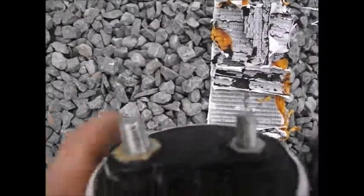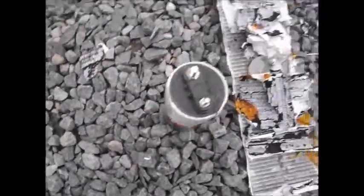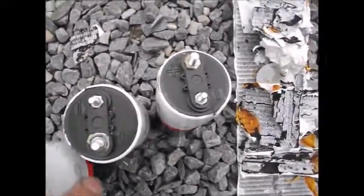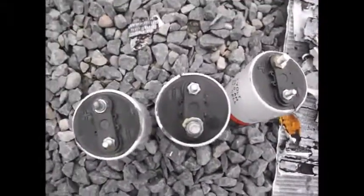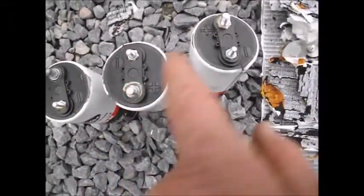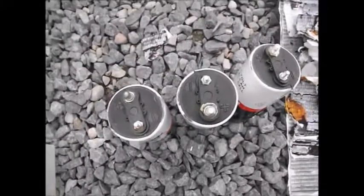As you can see the threads here — they have these little plates that go across that join them together. So basically they'd be upright like this, then you take another one upright like that, and another one upright like that, and these little plates go across to join your cells together. This one here would be 6 volt if it was just three of them — a plate would go from here to here, you put your lock washers on and put your nuts on top, and your positive would be here and your negative would be here, and that would give you 6 volts. Okay folks, thank you for watching. Subscribe if you would, and if you already have, thank you.